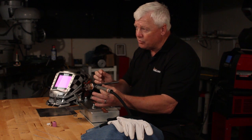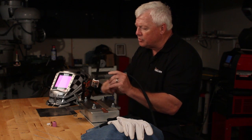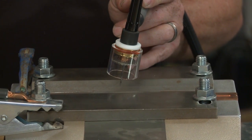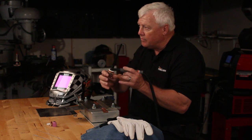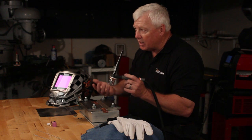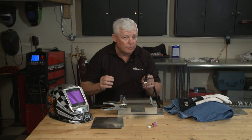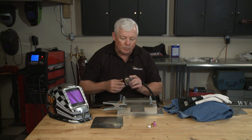When I say intermediate, we're going to do about 40 thousandths wall thickness with this. The shielding pattern on this is quite broad, and because I have such a heat sink here, I'm going to be able to weld this complete. I'll tack it first, but I'll weld it complete with no other purging other than this jumbo gas lens. I'm going to introduce argon from the back side at about 10 CFH, and on this torch itself I'm going to run about 30 CFH. Now I'll get my safety gear in place and we'll get started.